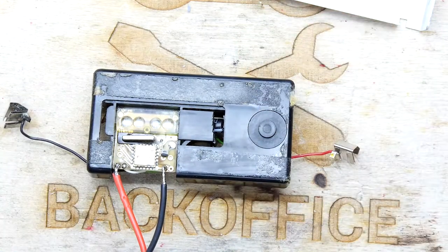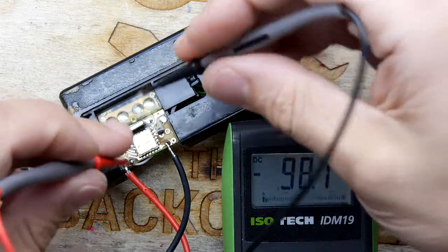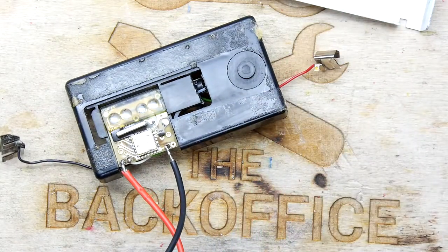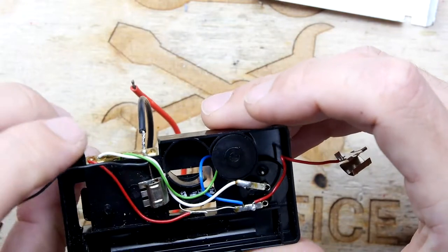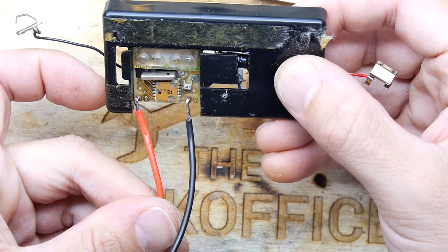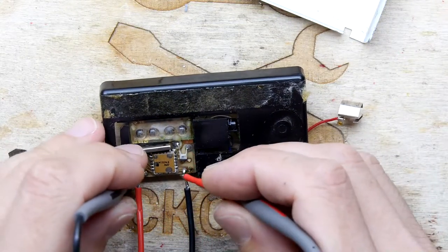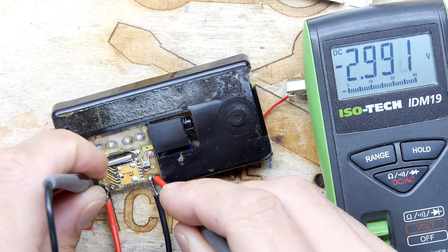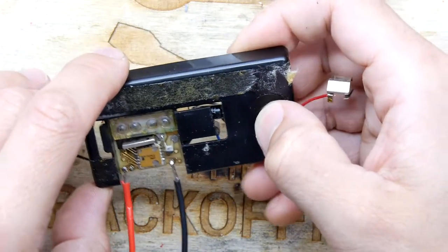The first thing I'm noticing is nothing on the screen. Let's do a sanity check — check for power. 2.6 volts. It might well need the full three volts though — that's something fair to assume. So it's up to the bench power supply now at 2.99 volts — yes, 2.99 volts. Still pretty dead. It's not measuring any current — well, maybe like 2 milliamps, but I don't think it ever goes less than 2 milliamps on there.